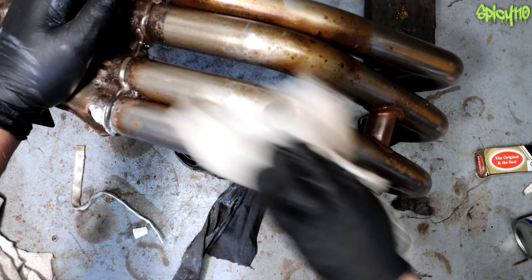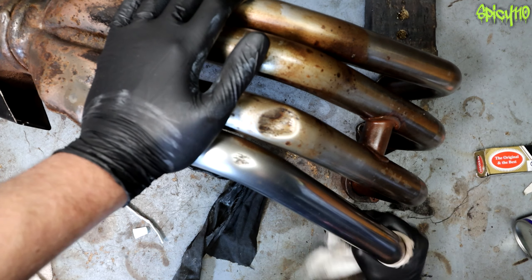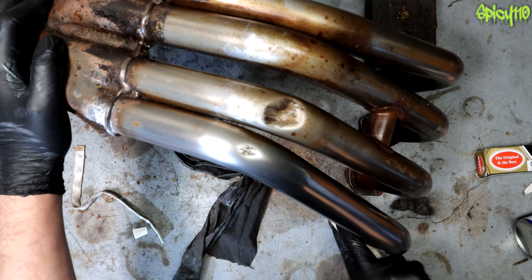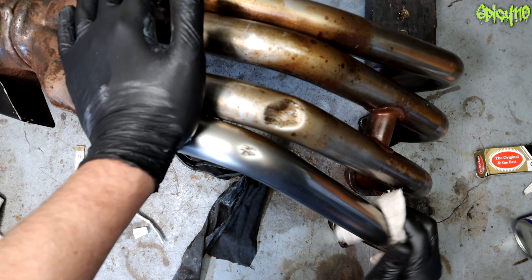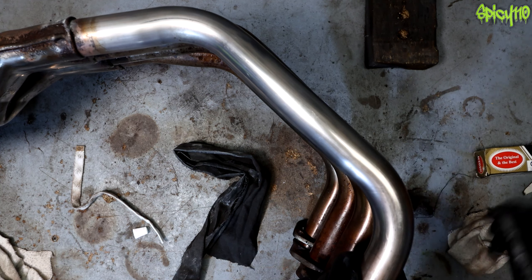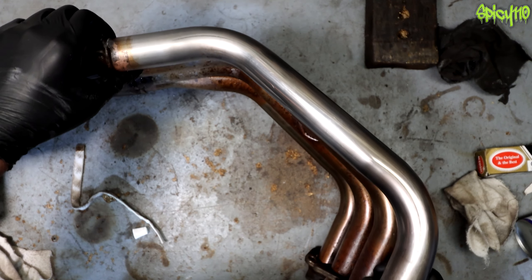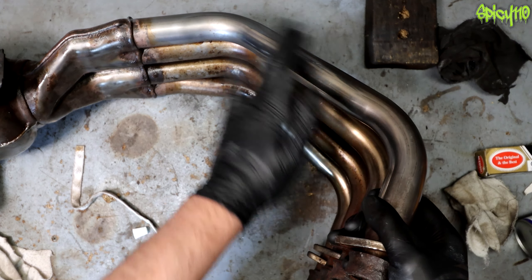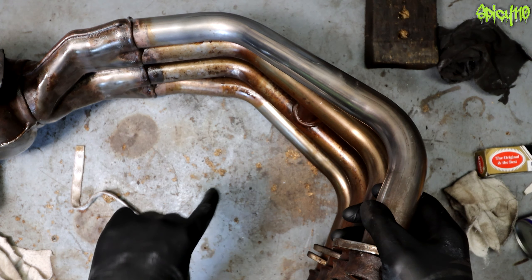I really have not spent nearly as much time on this as you'd probably want to if you're doing it to your bike — I just wanted to show what a difference you can make with some basic bits and pieces: WD-40, small rags, a few minutes. Also note — a polished surface is less likely to rust than a non-polished surface. This one has been wire-wooled and polished, and it's actually starting to become a bit more mirrored. If you spent more time and did a couple more passes of polishing, you'd get closer and closer to a mirror finish.